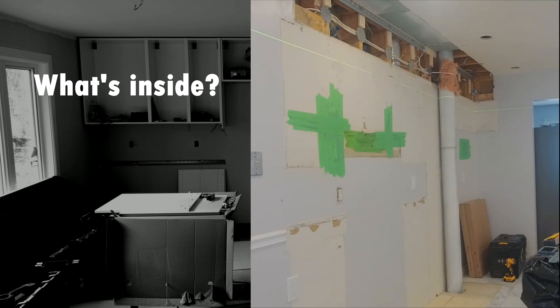A very good reason to keep the bulkhead in your layout plan is that it can be full of cables and wires. Sometimes those wires cannot be rerouted without a lot of work. As you see in this picture, that was exactly the case. The client wanted the cabinets to run all the way up, so it came with a cost — all those wires had to be pushed back into the wall and drywall added so we could hang the suspension rails. You can check by poking a hole into your bulkhead to see what's inside, and then decide whether to keep it or take it down.